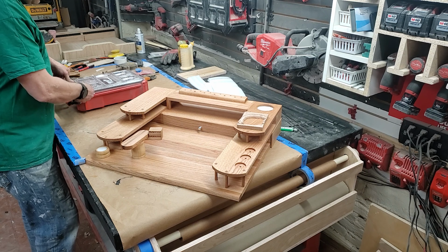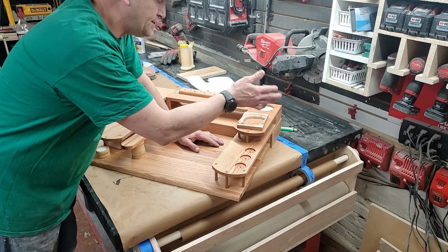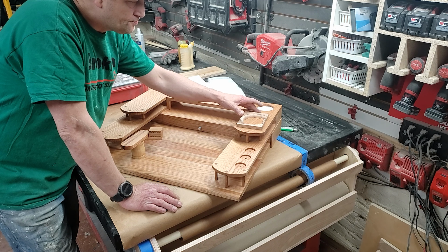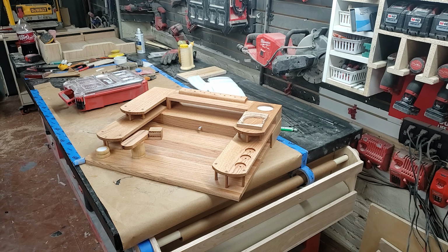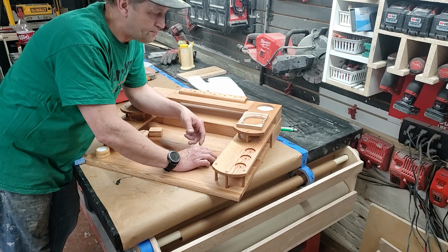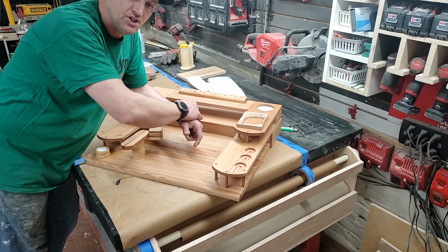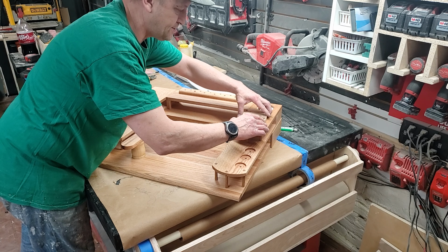Then I went to try to fix it, and I figured, all right, we got some indents, we got some movement, so I'll take the router with a 1-inch, oh, I don't even know what the bit's called, man. Roundover. So I figured I'd try to fix it with a 1-inch roundover bit. That didn't work. The depth of it, it hit the bottom, and when it hit the bottom, it jerked the router. So this is what it turned out after all those mishaps.